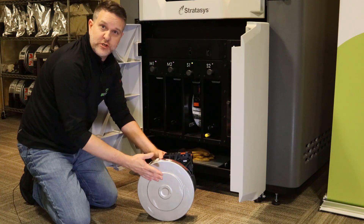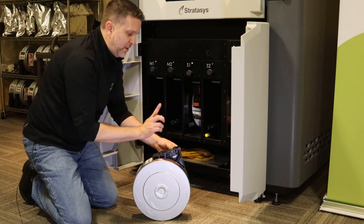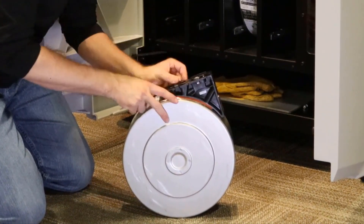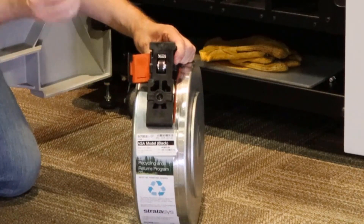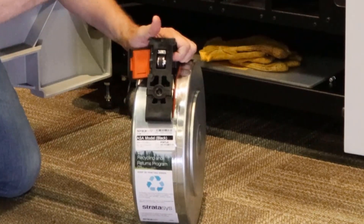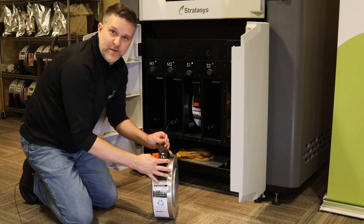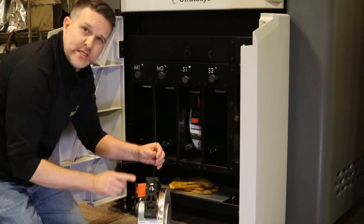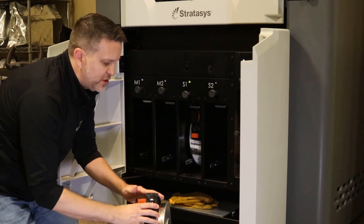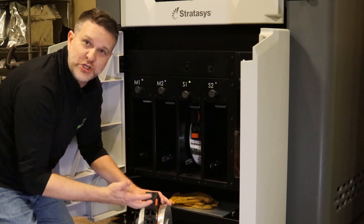When you get a used canister off of your shelf, you again always want to take the front clip off, open the door, and press on the drive wheel. An important tip: if you get to this drive wheel and find that it just won't spin or it's not feeding material out, there's a little tiny spring clip right in here. Take a screwdriver and simply apply a good quarter of a turn to either one of those screws — it will loosen up that spring clip's tension on the material and make it easier to feed out. Even if you have a canister you've used before, always still pull out a foot of material and feel that spool turning. Always make sure it's free before you clip it off, push back flush, and close that door. I don't want to load a canister that might be cross-wound. Even if it's not new, always check before you load it.